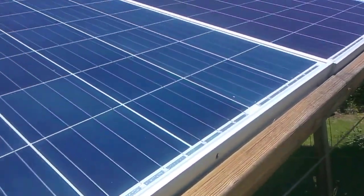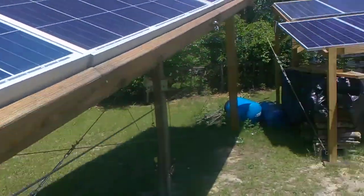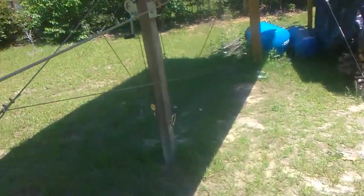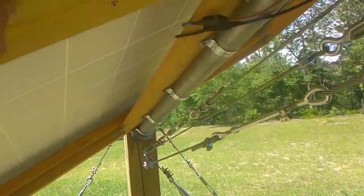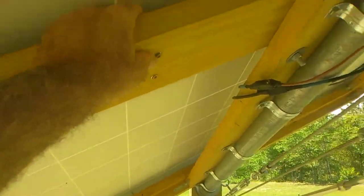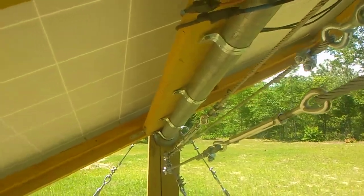You've got to start from the bottom and push one panel up at a time — with this being level, because otherwise it'd be hard to put a solar panel up there at this angle. Once they're all set in place, you just take some sheetrock screws or decking screws, put a washer behind it, and drill right into the frame. Put a bunch of those in and that'll hold it in place — it ain't gonna go nowhere.